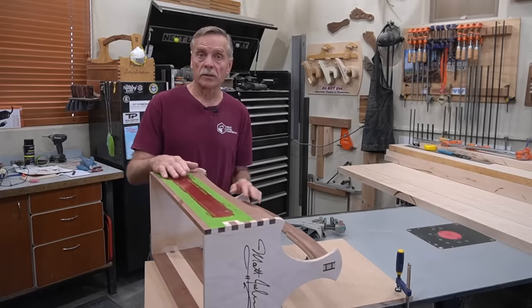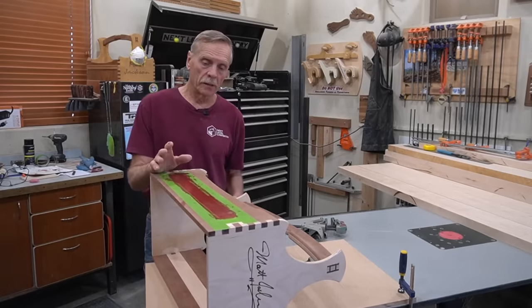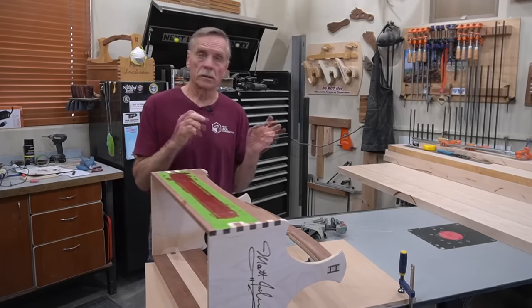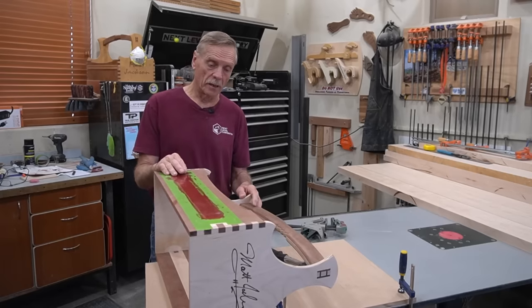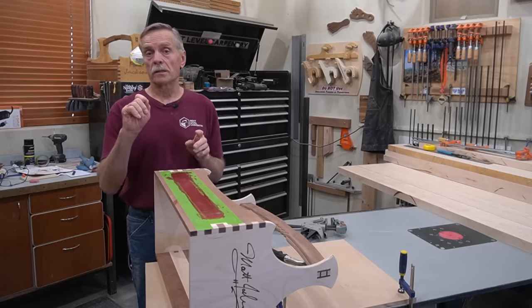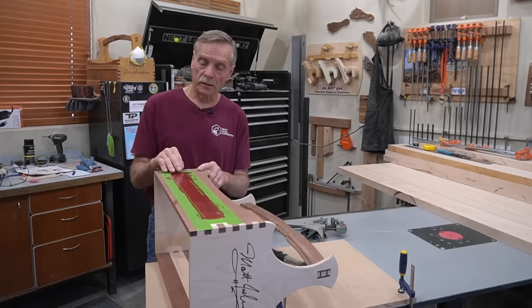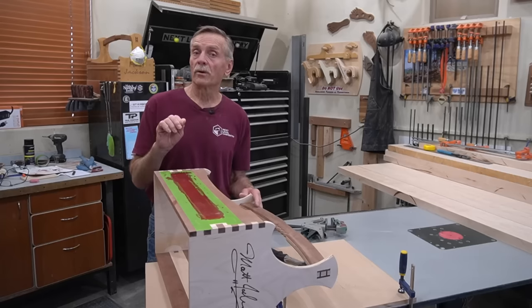I feel better about this epoxy after letting it dry overnight, even though it's 75-minute epoxy. I think the cure time is extended because the concentration of mica powder slows down the cross-linking of the epoxy itself. But now that it's set up overnight, I'll finish up with this. And what you saw using the thin CA glue for sealing is the first pro tip for epoxy filling laser engravings. But to me, the next pro tip I'm going to show you is even more significant.